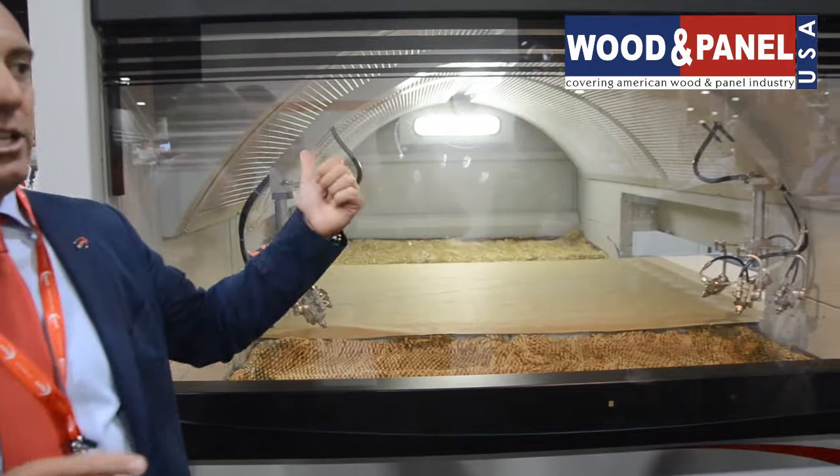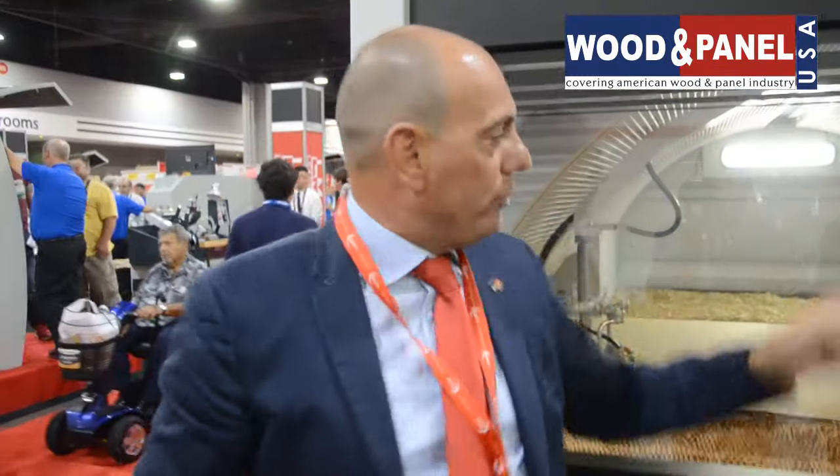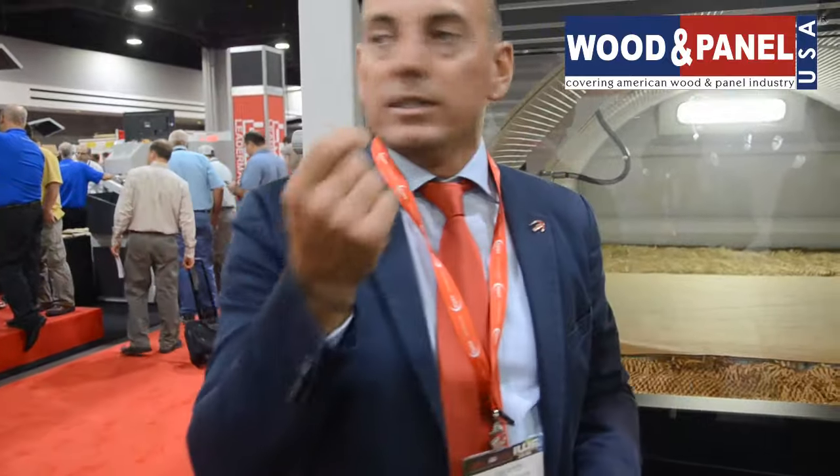So avoiding waste of lacquer during the spraying process — when I'm spraying, I'm creating a big cloud of overspray and the entire purpose is to get that cloud onto the piece because that's where I want my paint to go. One important characteristic of this machine is the plenum. We studied this with a university in Italy to see the airflow, because we want the airflow to go through the filters onto the central part of the machine and onto the piece so that we have better transfer efficiency — because that's where customers are counting their money spent on lacquer and how much ends up on their piece.